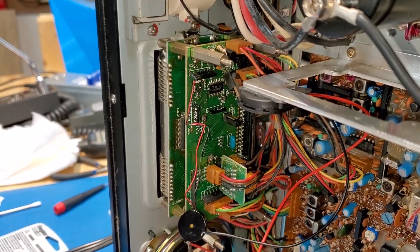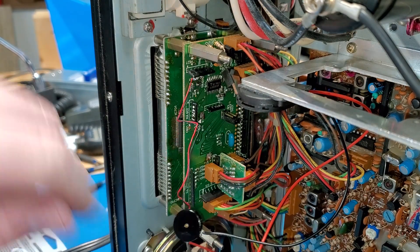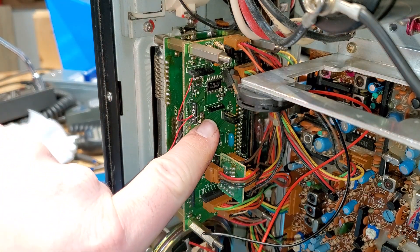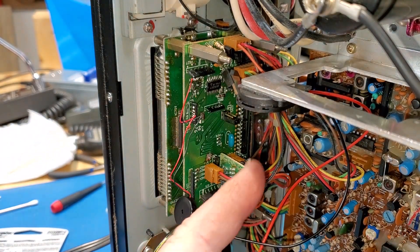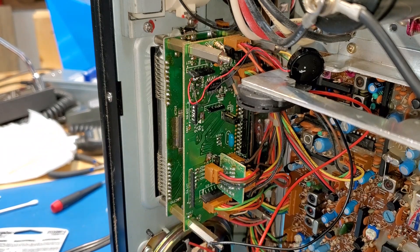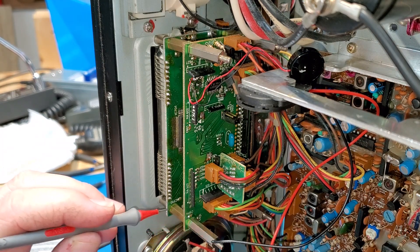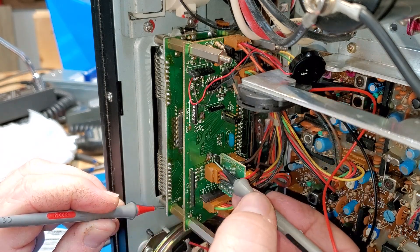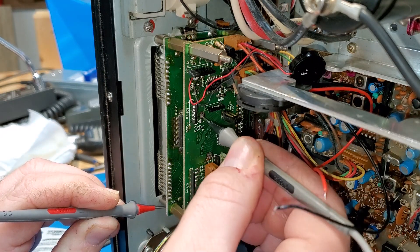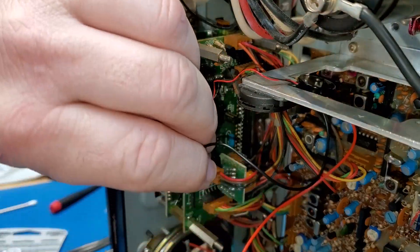Getting ready to mount this in the radio — standing it on its end, this is the back of the board. There's a terminal here and a terminal there; the old coin cell used to be soldered in there. This one says 'V minus' but the markings don't directly indicate battery orientation, so I did a quick check with my multimeter. The boards are grounded through the standoffs, so touching the ground standoff and one pad confirmed that one is negative, and the other pad gave nothing, so that's positive.